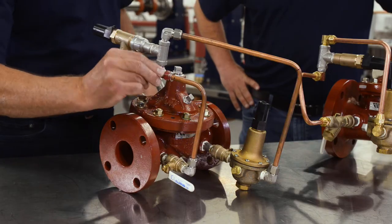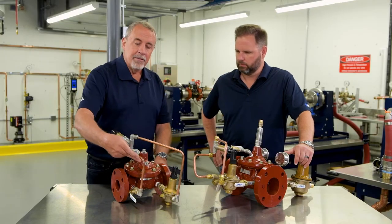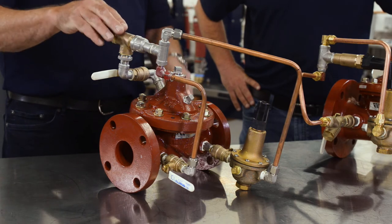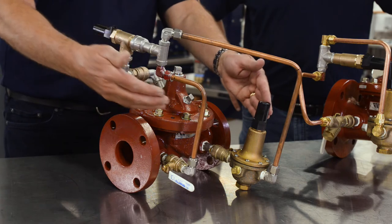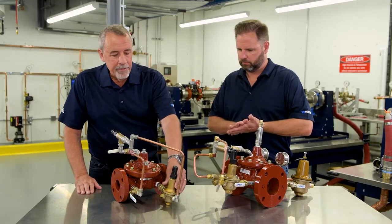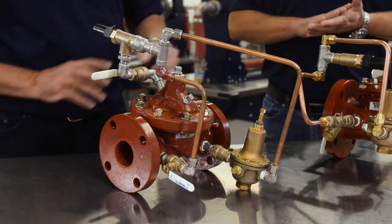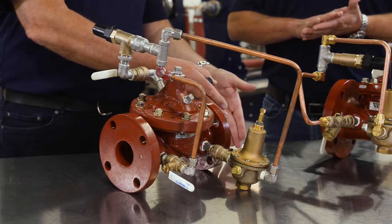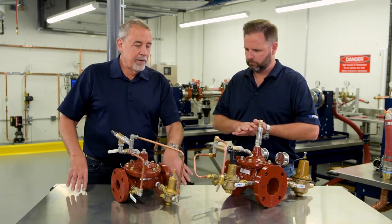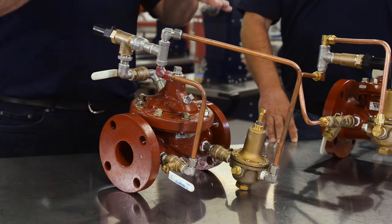Let's follow the water through. This device is called an orifice fitting, and inside of there is a very small diameter hole that slows the water coming into the split. It comes down onto the cap. This is known as a speed opening control, and what you want to do is make sure that water can come off faster than water comes on, so that you can actually regulate the valve open and closed. This device here is a direct acting valve called the pilot, and the pilot valve is actually the brains of the operation. It is set to sense your downstream pressures — I want 60 psi. It's going to constantly monitor that 60 psi downstream and allow water off or on the cap to open and close that valve.